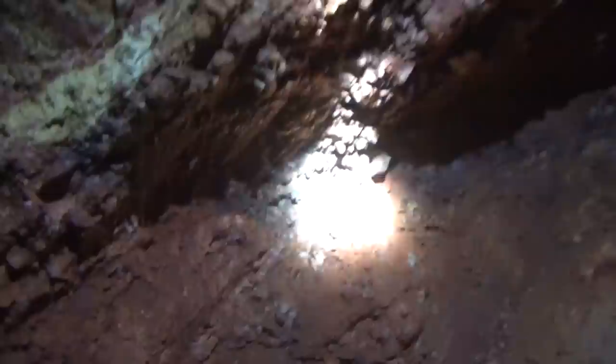Ooh, but man, this rock is soft. That's because it's saturated. Now these are columns here that were left behind, and it's obvious why they left them here for structural support. And you'll see these in mines a lot. Sometimes they're a lot bigger than this. Now, it's obvious that the band of mineralization is right here. But you can also see how soft it is. See how soft that is? I can practically pull it out with my finger. Manganese oxide in the mix, and you're gonna see that a lot in the USGS reports.